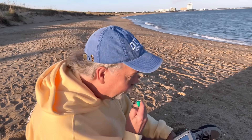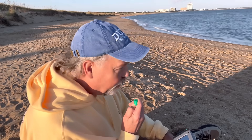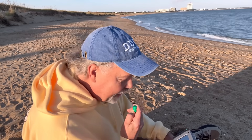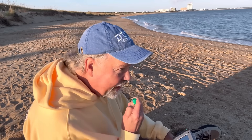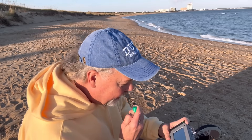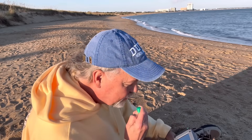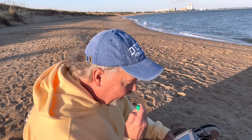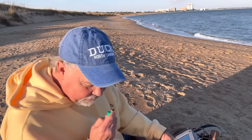It is amazing. I've just got a little telescopic whip vertical, trimmed down to a quarter wavelength, with four counterpoise wires on the wet sand here, just sitting on the beach. Thank you so much — you've made my entire weekend. It's nice to know with this little radio in the palm of my hand, with two batteries in it — basically 7.4 volts total — I'm putting out about five watts and getting through to you. I appreciate it so much. Victor Kilo 6 Bravo Tango, Kilo 4 Oscar Golf Oscar, 73.